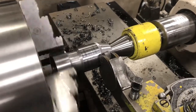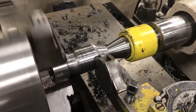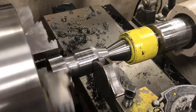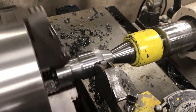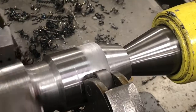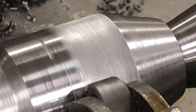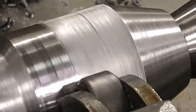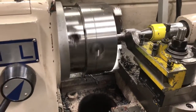The spindle goes back on — the feed was never disengaged. The problem is, if you disengage the feed while the spindle is running, you'll end up with a ring right around the knurl. Now because we're going so slow, when we get the wheel halfway across the other end of the workpiece, we're going to slide out of drive and put it into reverse. At that point, don't be shy about taking an extra feed out. Be careful about allowing the wheel off the end of the workpiece — you don't want to allow that to happen.